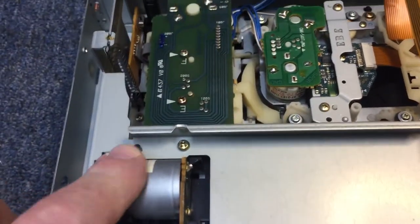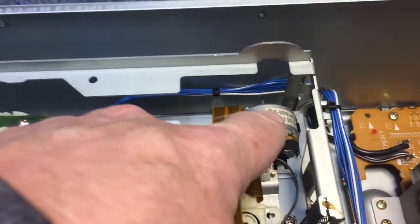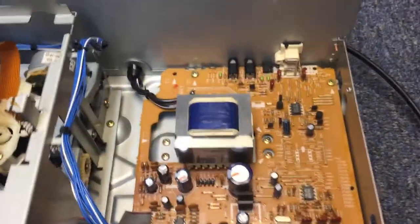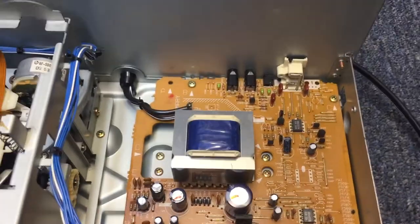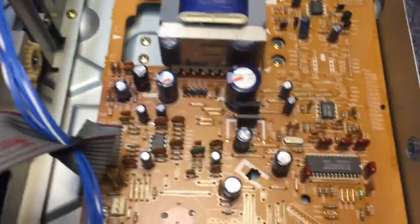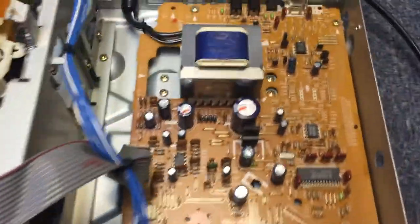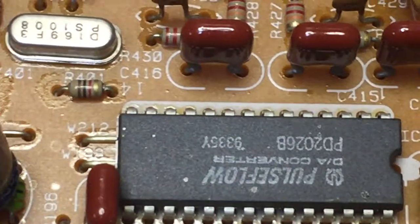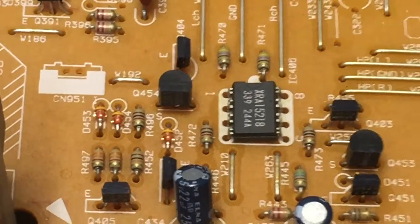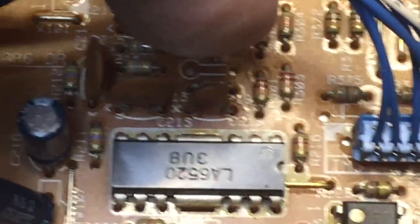You've got some motors here to slide your disc in and out, raise the elevator up and down, and one may be for the clamp to clamp onto the disc. Over here, a very streamlined setup in the circuitry — transformer mounted to the bottom of the unit but soldered onto the main circuit board, followed by what I believe is a surface mount systems control or servo, and a Pioneer D-to-A converter right here. Pulse flow D-to-A converter, a few op-amps — 4558s — and the output side. Not a ton of supporting circuitry. This should be a motor controller, LA-6520, I believe.